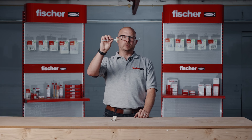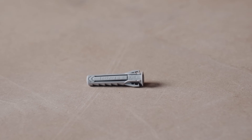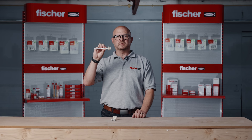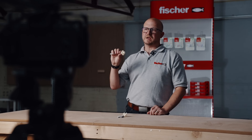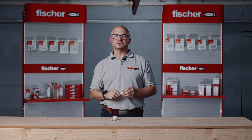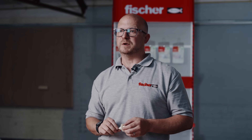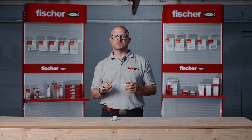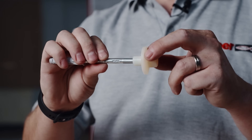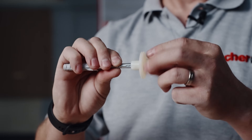The WD8x100 is ideal for smaller wall hung basins and can also be used in wooden battens. It comes with SX Plus plugs enabling fixation in solid walls, but can also be installed in a timber batten wall. To install, mark out the position of the sink and drill the two holes using a PGM stamped drill bit. Plug the holes using the SX Plus and screw in the studs. Fit the sink onto the studs and finish the installation by fitting and tightening the plastic collar nuts, which will also protect the ceramic from damage.